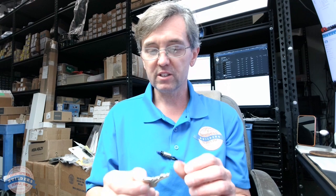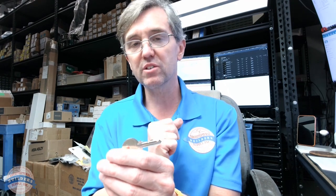And then the problem with that is exactly where I get the needle for my spacing and my depth is going to vary inherently. So I like to take this over to the duplicator because my duplicator being calibrated to tolerance, I'm going to get really good copies of this every single time. So let's move on and do that now.